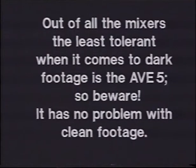You may want to make a couple test tapes to see what happens on your screen with your digital mixer online and what happens with the digital mixer offline. That way you can make an intelligent choice on your own. If it makes the picture worse, you're probably better off not using it while you edit. When in doubt, leave it out.